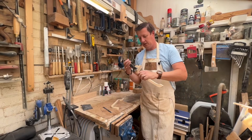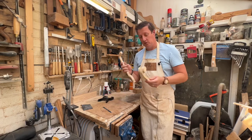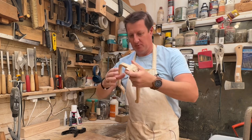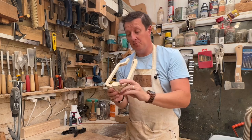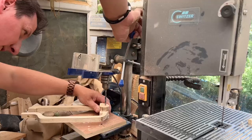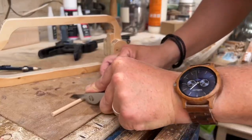These have had over an hour to set — more than long enough. We've just got to put this in here, quite snug, which isn't a bad thing. I'm going to push that right in to where it needs to be, and then a simple 6mm hole all the way through all three of them. I've got some 6mm dowelling.